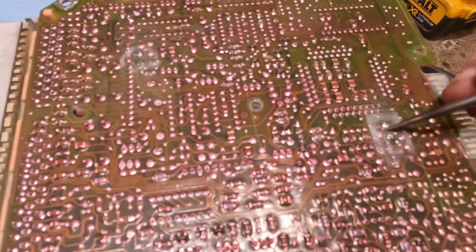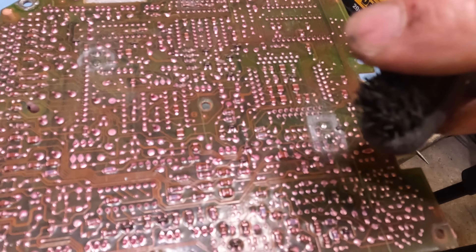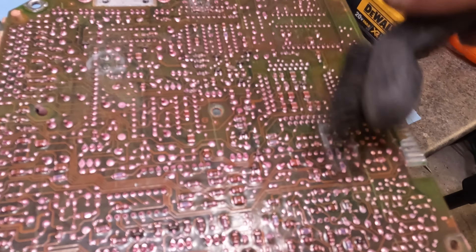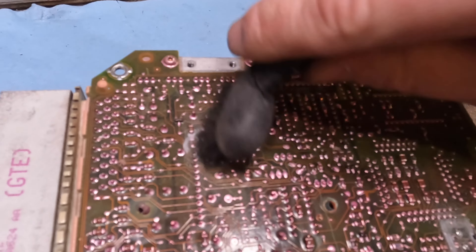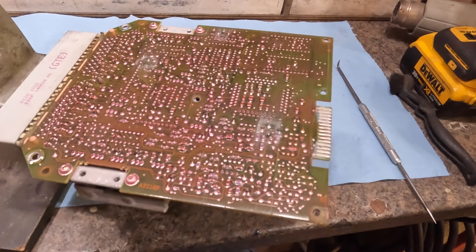I have highlighted the three areas where I need to remove the rubberized conformal coating off the back of these connections so the soldering iron will properly work. I'll use a scribe or a small screwdriver and gently poke through this rubberized coating to get it away from the areas where I need to desolder these legs. I cleaned up all the conformal coating around the pins and used a little nylon brush to get the bits of dust and crud off.